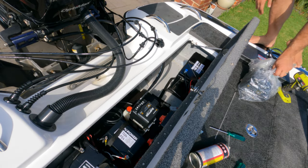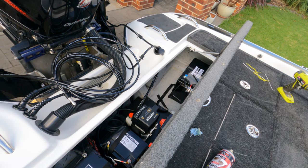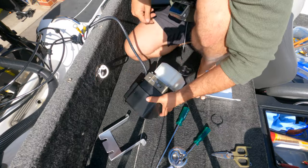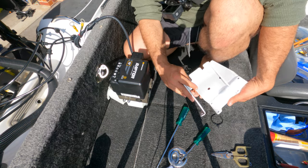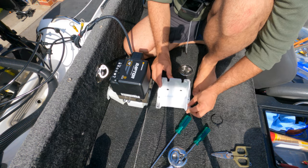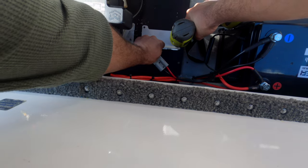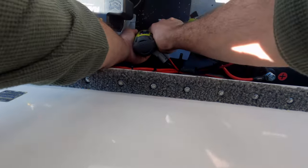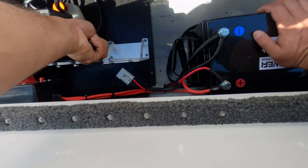Before drilling into the boat to feed hydraulic lines through the hull, work out exactly where you want to mount your hydraulic pumps in the back of the boat. Minn Kota have done a good job here — the reservoir can angle around for tight spaces, but because I've got lithium batteries in the back I had plenty of room. The mounting plate has holes so you can mount on a vertical surface like a trunk wall, but I went onto a steel plate above some livewell pumps, which allows me to remove or reinstall it without drilling into my fiberglass boat. I drilled a pilot hole in the plate, orientated the serrated washer the right way, installed the stainless steel screws that came with the unit, and the mounts were in.